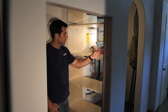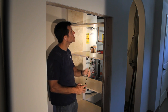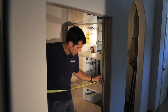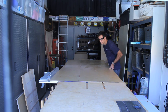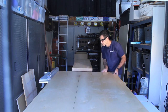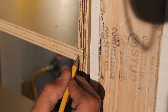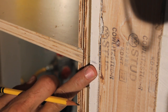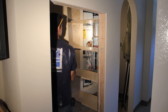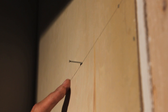I've pulled the refrigerator out, which gives me access to the back side of this cabinet. Now I measure for my plywood back and go ahead and cut it. Before putting the cabinet back, I mark the center line of all my shelves so when I go to nail, I'll have a good reference point. Now I'm ready to position the panel in place and transfer all the lines to indicate the center of my shelves, then drive some nails in.